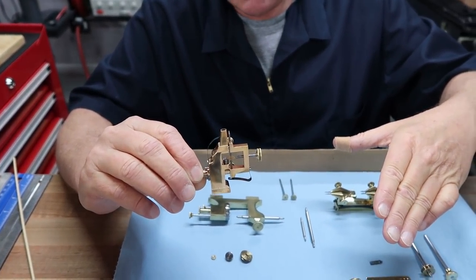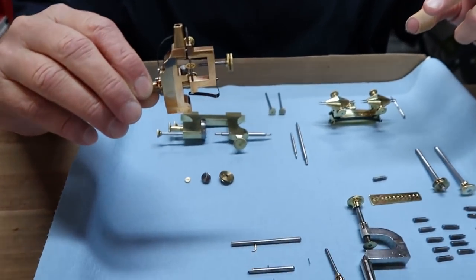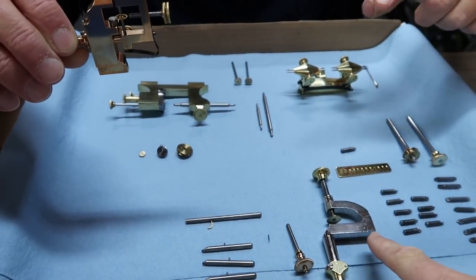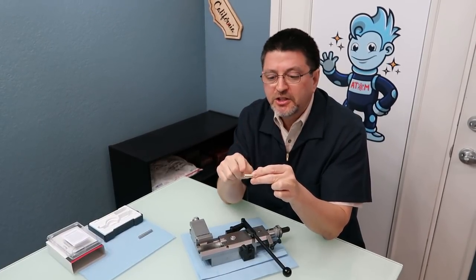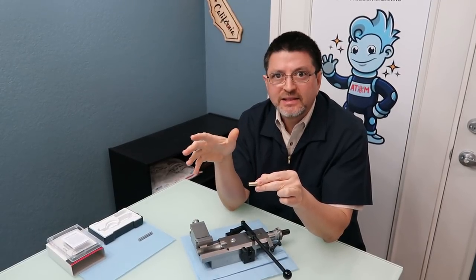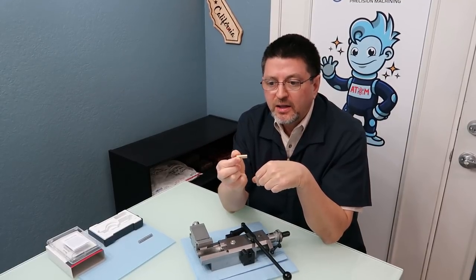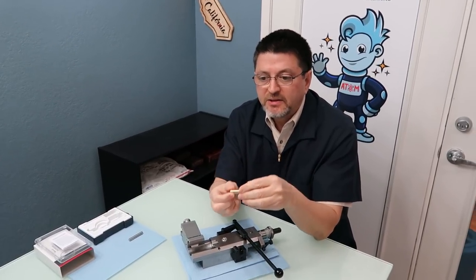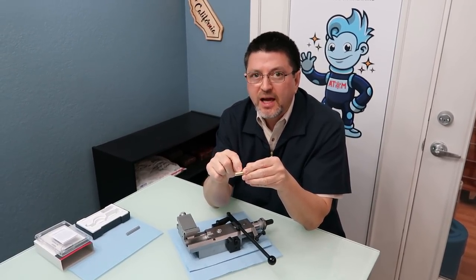That's correct. Three of the tools — the only one that didn't come from my grandfather is this one right here. Oh, the bezel set tool. Yeah. But what I'm going to do is take you for a little ride out to the machine shop. I'm going to use our little TAG CNC milling machine, put this in a 5C collet block, secure it to the table, and then with a little tiny end mill, I'm just going to make the little slot.